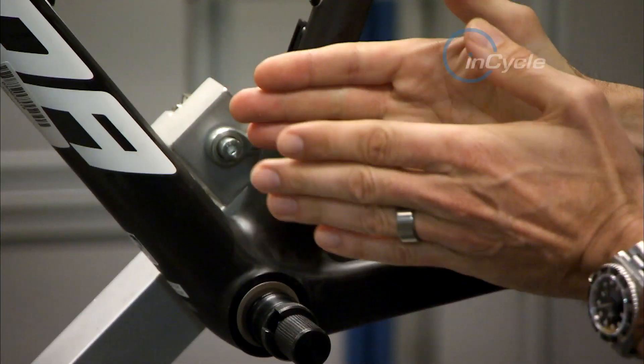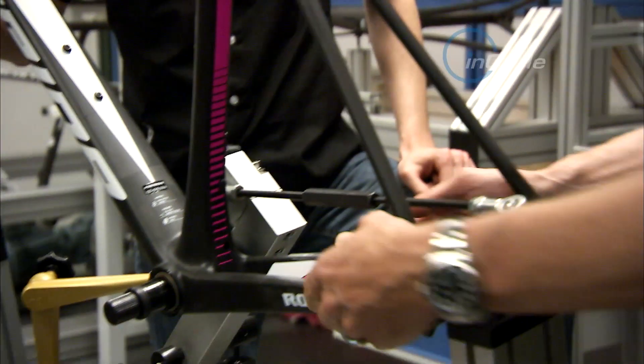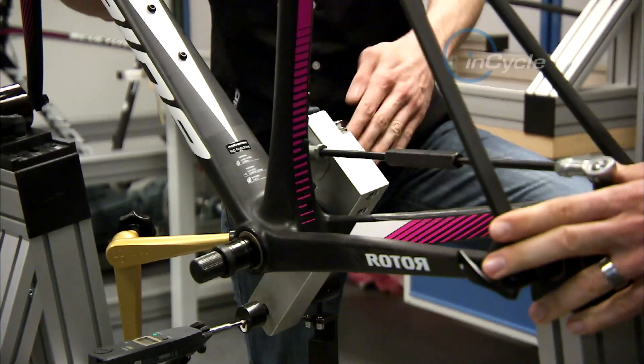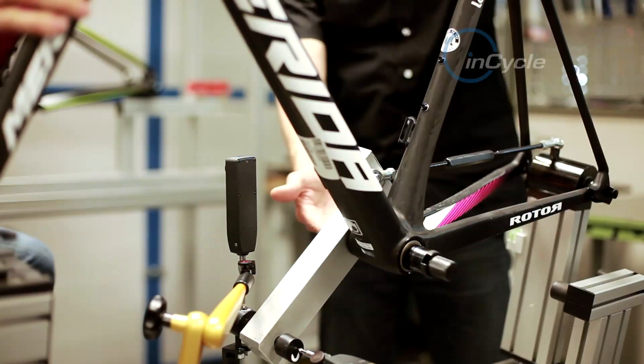Today it's possible to go even under 700 grams. Simulation and testing in the design process means there's no compromise on frame strength in pursuit of the ultimate. But if you really look at the performance, every 10 grams below 800 grams of frame weight, you potentially lose 5 to 10 percent performance. That means 50 grams less means 20 percent less head tube stiffness and bottom bracket stiffness.